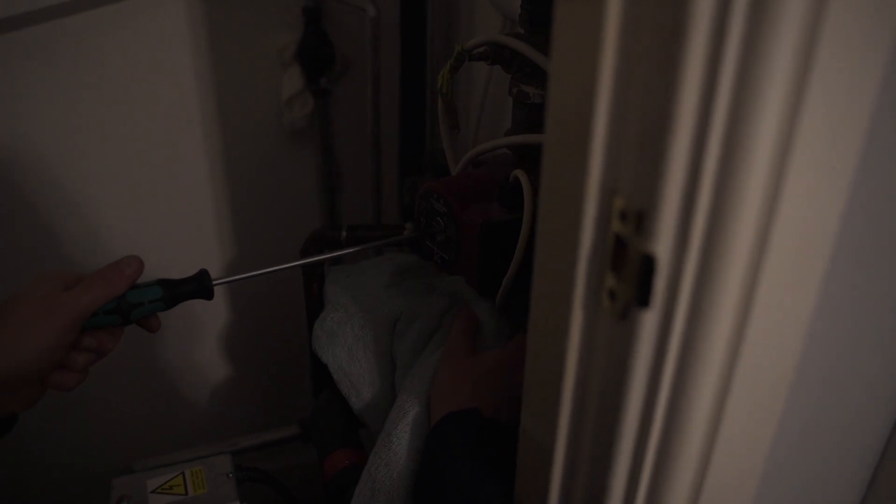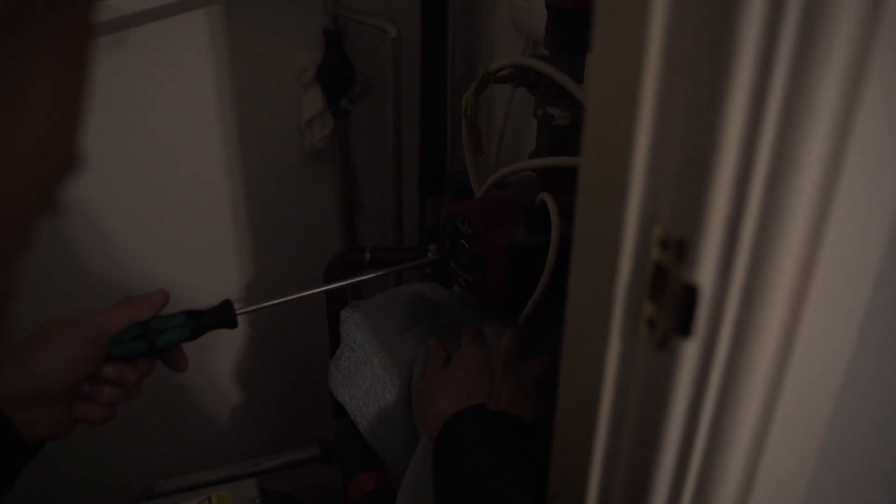I'm just coming in here Brad - so that's the pump and that's the bleed key. What we're trying to do is get all the air out of here. There's quite a bit in there. You can hear the pump making different noises. We're waiting until we get some temperature. We have got a bit of heat now. You can hear that - that's a huge airlock shifting. So that's just a bleed. Now we are probably going to have a little bit more air in there, but the pressure is close to one bar, which is good. It is now circulating.